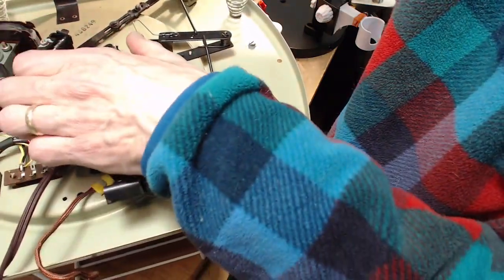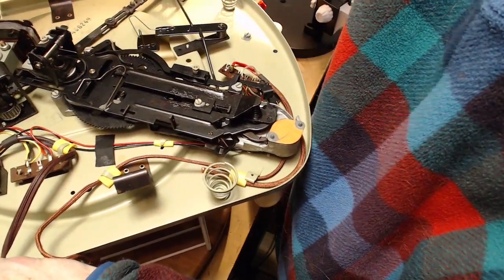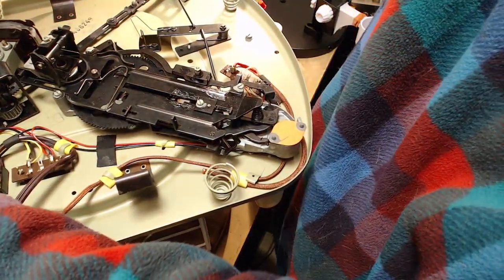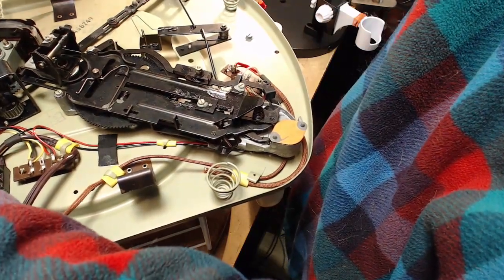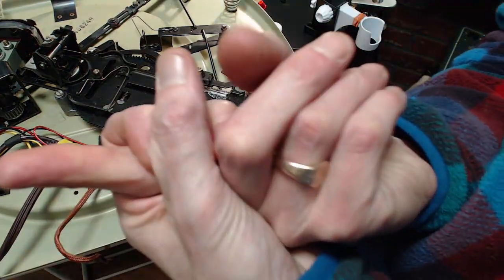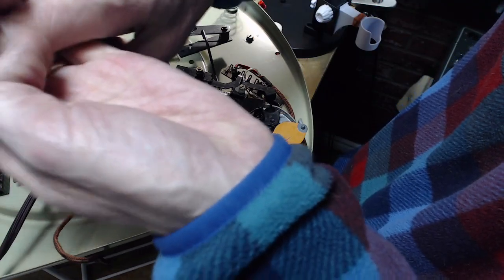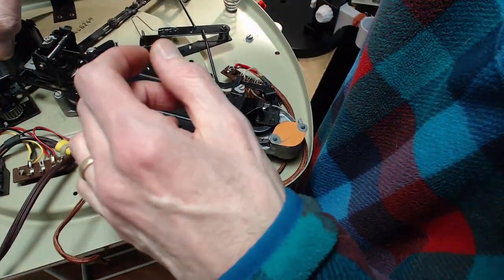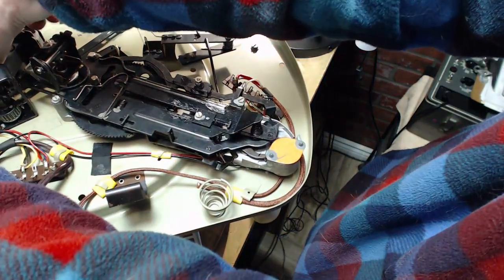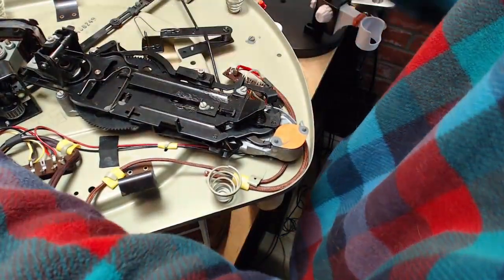Now, the record player is upside down, so normally the weight of the rotor is pushing on this. It's sitting on it basically. The lower bearing is important in these motors more than the upper bearing. The upper bearing is actually a shaft going through, and that's the shaft that has the various diameters on it for speed, right? So you have to lubricate this bearing part. But this is different. This part back here, different here. Straight up. I think the screw is still in.